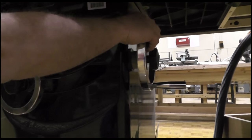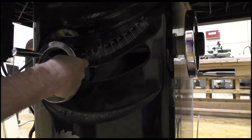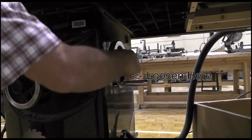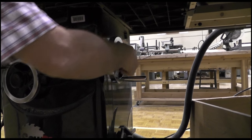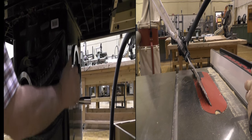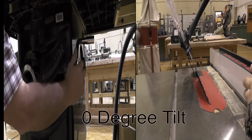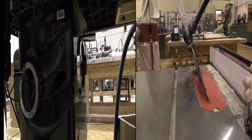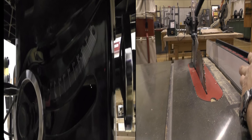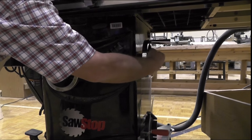This is the scale for the tilt — some would call it a bevel — and this is the wheel that operates it. Right now we're on a two-degree tilt, which most people would not want. Loosen it up here and turn it counter-clockwise to set it to a zero tilt, so now the blade is exactly 90 degrees up and down. It can go all the way out to a 45-degree tilt. I'll anchor that in position.